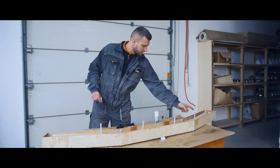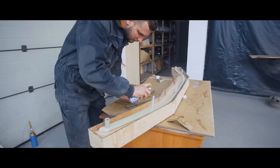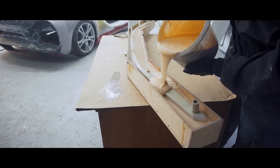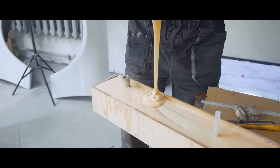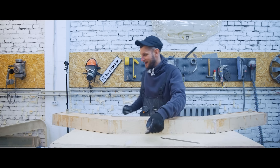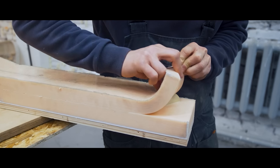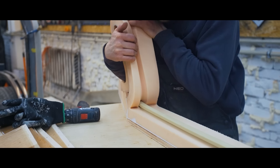The piece is waxed and our tubes fell off, but that's okay — we're gonna glue them to the same spot and they'll stay glued when we remove the wax. The next step is to apply the release agent on the dry layer of silicone; we use wax spray. Then we pour another bucket of silicone. The next day the silicone is dry and we unpack it. We disassemble the formwork and you can clearly see how this technology works. It turned out to be perfect — we can easily make such complex forms. But unfortunately, not in this case.